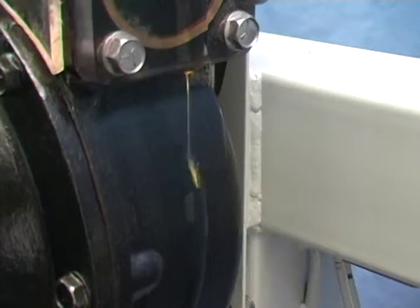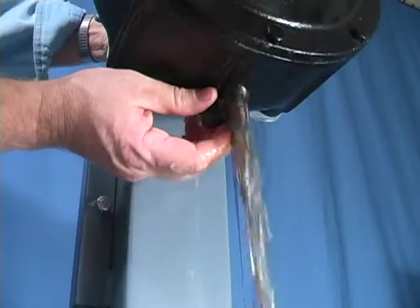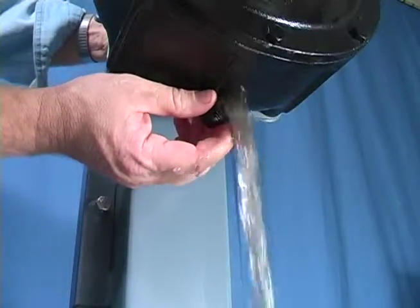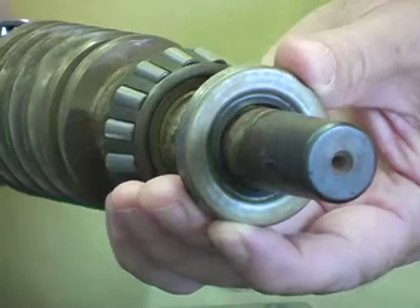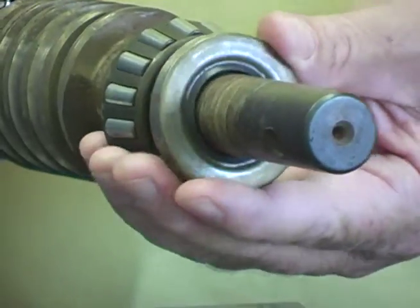If you have oil leaking out, you also have water leaking in. Normally, the problem with these gearboxes starts with water leaking in. The problem with the gearboxes is they all have about 3 seals in them. And you're working in muddy operations, sunny operations, and it's a constant expansion and contraction, and sometimes you get water in the boxes and sometimes you just lose the oil.